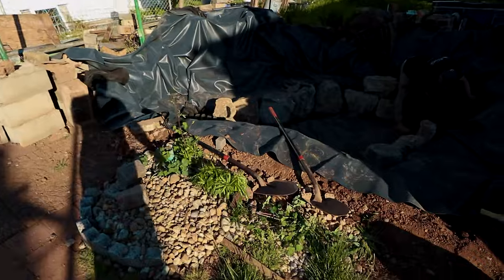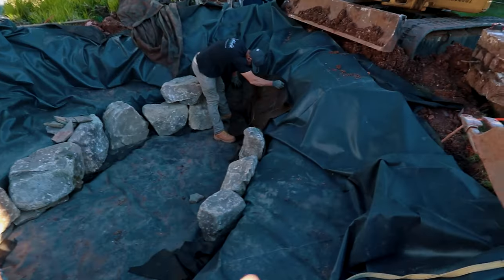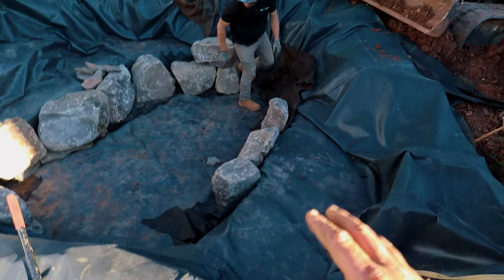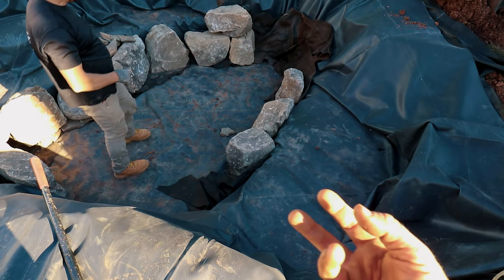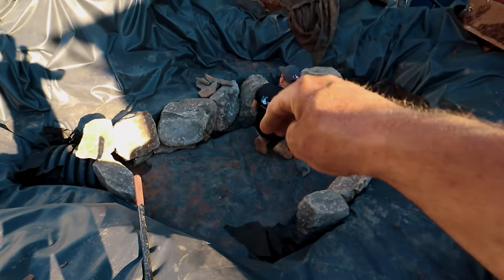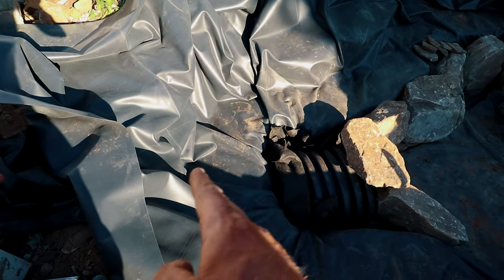So they love their fish, and they also love gardening. They've got gardens all around the yard. So we have these really, really over-exaggerated shelves for a couple of reasons. One, you can put in some marginal plants along the edges, but it also makes it super interactive for when the fish want to feed. It's not as deep as the rest of the pond. Where Bowley's at, we've got over 30 inches of depth. Fish cave tucked in the corner here, and again, some over-exaggerated shelves.